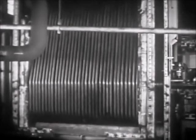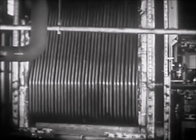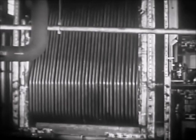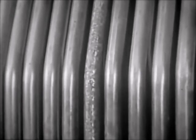The tube, or tubes, are removed to determine conditions within the boiler at regular overhaul periods or for inspection. The tube selected for removal should be the oldest tube in service, determined from the machinery history and boiler record sheet.